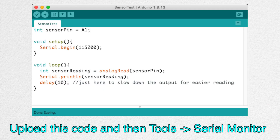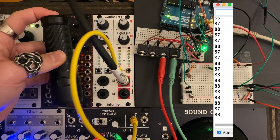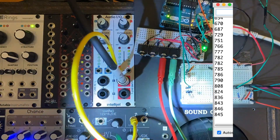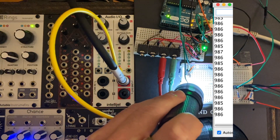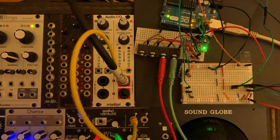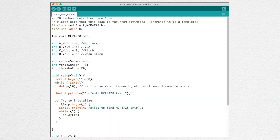I recommend using a code like this to see the minimum and maximum sensor value. The light sensor value is around a certain value when we're not shining light at it — that value is mapped to 0V. And when I shine light at it very close to the sensor, the value goes to its maximum, and this is scaled to 5V. The code obviously should be a bit more optimized than this, but it depends on your project so I can't really provide the best possible code that fulfills everyone's need.